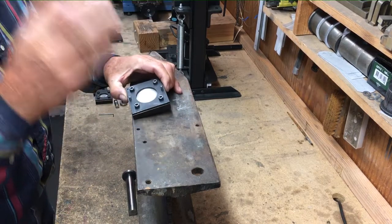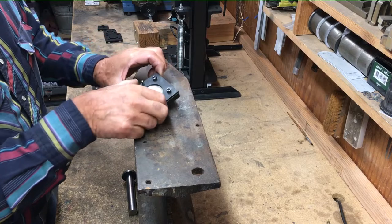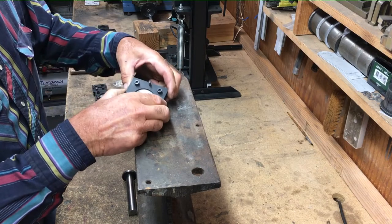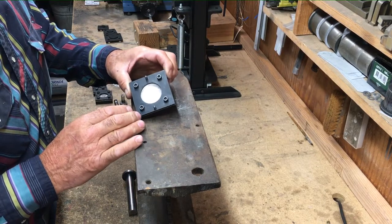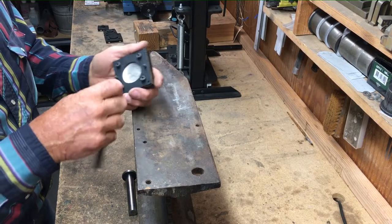So when you look at it and get your light just right, you can look at the edge and you can catch the reflection to see if you've domed it all evenly. If you spot a spot where the reflection has a, you know, it'll just show you that it's not quite domed fully. And that's really easy to spot. Just go back and do a little more.